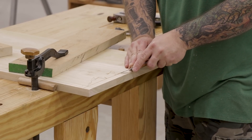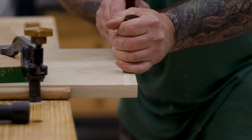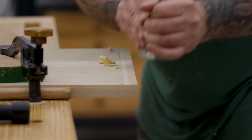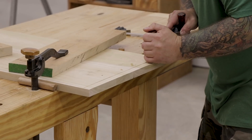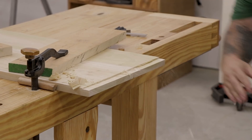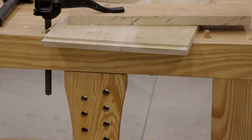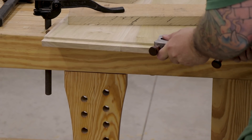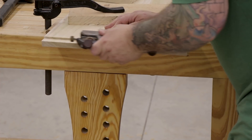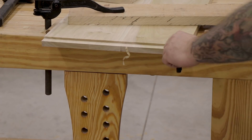I'll use my marking knife to carve in a slope and shoulder that my shoulder plane will be able to ride in. Then I'll tilt the shoulder plane inwards towards the shoulder I just created, take a few passes to establish the rabbet, and once the shoulder is established I can tilt the plane back to level and plane away the material down to the scribe lines. I'll use my combination square to make sure the depth and width are correct all the way down the board, and correct any deviations with the shoulder plane. Both ways work pretty well — I like using the rabbet plane with a fence because it's a little faster, but you could get by with just a shoulder plane, or even a chisel if you had to.